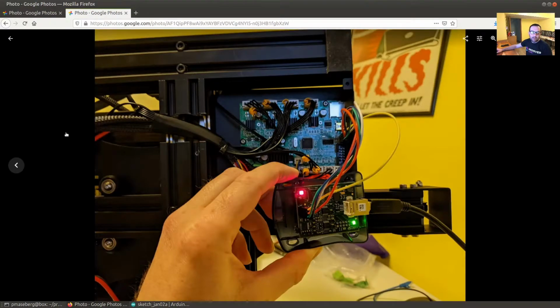If you were to have an Ender 3, for example, their motherboard puts it way over here, and it's too close to the edge to actually connect it, so I had to use these wires. And in this case, if I lined up the USB on my programmer to the front side the same way as the USB here, I could just match them pin for pin. And right now there's no power to this board, and so this red light is showing up on my programmer. With my programmer, you would see a green light once it's successfully connected the correct way and there's power to the board. And so this is connecting to your computer for data, and then oftentimes you'll need to just connect the mini USB to power so this board comes on and starts talking to this. And so that is how you can connect the hardware up to get your bootloader ready to be put on there.